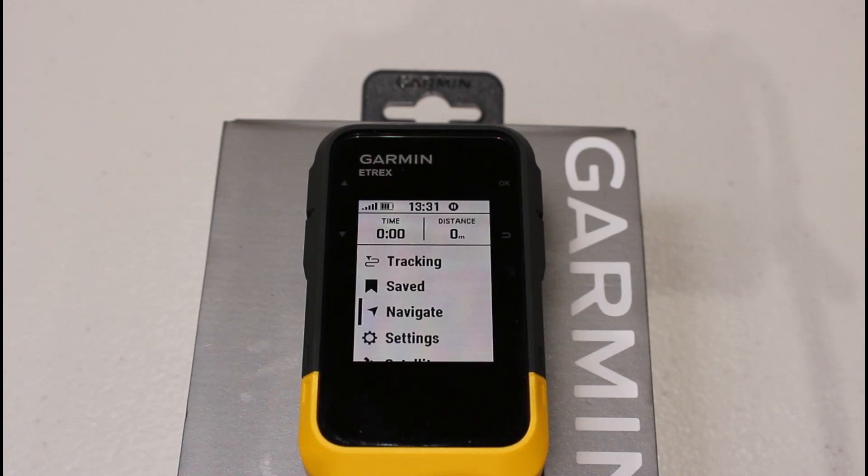When you're walking with the unit, it uses GPS satellite signal to determine the way you're heading. But when you're standing still, it uses the electronic compass to align the compass and also align the map screen. If you've got a route displayed and you're following a black line, we recommend calibrating the compass when you've moved more than a hundred miles since you last calibrated it.